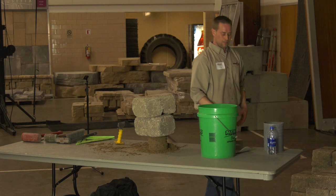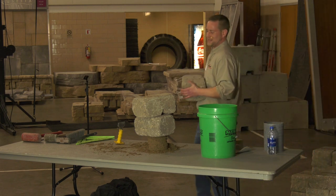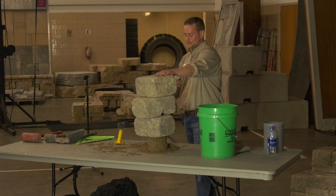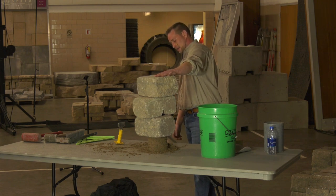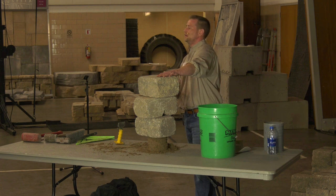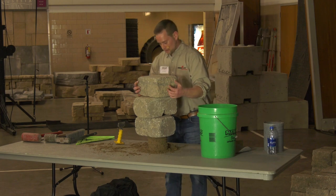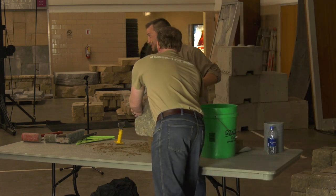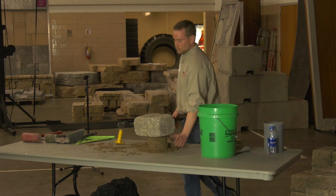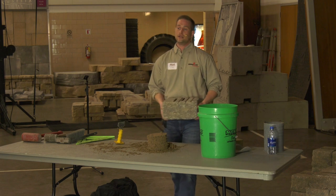Even after I shaved around the edges, let's put one more block on there. I'm not holding this block up at all — I'm just stabilizing it so it doesn't fall on me. But this little column of sand, because it's got the geogrid soil reinforcement in there, is able to carry more than three times the load that we initially introduced and saw failure with. The same principle is at work behind your retaining walls. This is why I like to show my new hires this — it drives home how important the geogrid is and why you can't skimp on grid lengths, grid quality, or the gradation of the grid. You have to make sure and follow what your engineer specs for your wall.